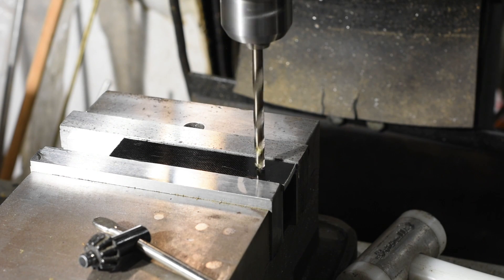There are three basic categories of steel that are used for drill bits. One is high-speed steel — that's the cheapest and least durable. Cobalt is kind of in the middle. And then carbide, which means actually tungsten carbide. Those are the most expensive and the highest quality, by and large, but they're certainly the hardest. So if you want to drill any kind of steel that's been hardened, you have to use carbide. I'm not going to say it's entirely impossible to use other drill bits, but you pretty much toast them as soon as you use them. High-speed steel and cobalt, you can get those down at your Home Depot, big box store, Lowe's, Ace Hardware — those are all available just kind of universally.